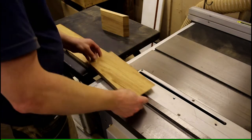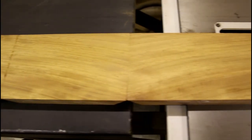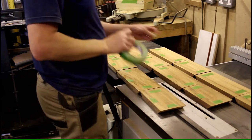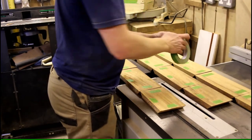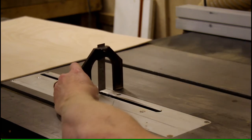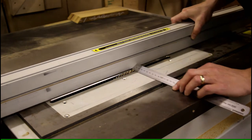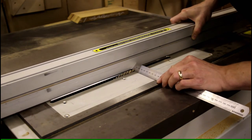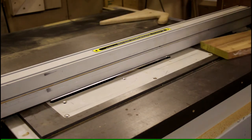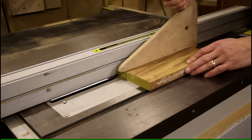I lay out my pieces and check that the grain flows round each corner. This teak has quite visible grain and the flow is quite noticeable. I then mark each corner with a small piece of painters tape to help me reorient them later. I straighten up the table saw blade and set the height to about a third of the thickness of the board. I set the fence to about 5mm from the blade and always make a few test cuts to check the setup. I then pass each board through the table saw to make a rebate to accept the plywood bases, sometimes making several cuts and moving the fence a tiny amount each time until the rebate is the right width.